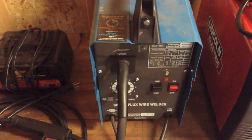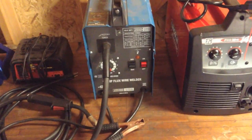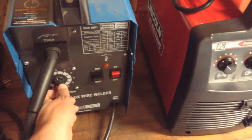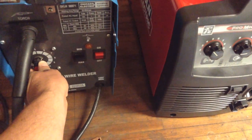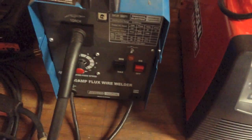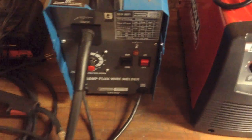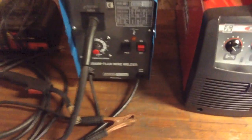Do that and it's going to work for you. Basically, this one has a knob here which adjusts the wire speed. If you need more wire or you're welding thicker steel, you increase that. And then this switch, you just have minimum and maximum — thicker metal, you want to use maximum because you get more current; thinner steel, you'd use minimum and it gives you less current. Between that and adjusting the wire speed, you'll get your weld there.